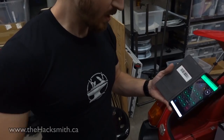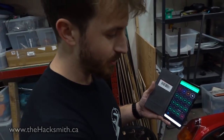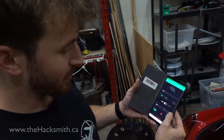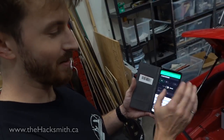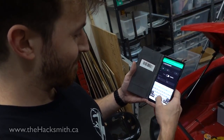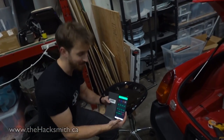This is sweet. All right, so programming the app is actually pretty simple. We're using something called Blynk, which communicates with the Bluetooth Arduino that we're using. So we can just go in and edit the button. Now, let's label our flamethrower exhaust. And we're gonna have it on or off instead of hold the button, because why not? Should it be fire or flame? Yeah, flame.